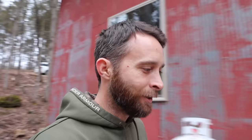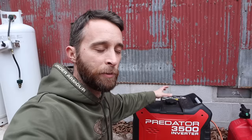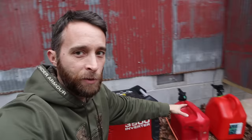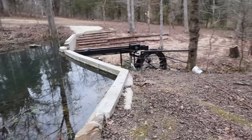So what are we doing for power? Just your trusty old generator. This is a Predator 3500 from Harbor Freight — not very expensive, I want to say about $800. I only have to run it in the mid-morning for a few hours to top off the batteries, and then again before bed, usually while we're cooking dinner. I'll usually shut it off at 10 o'clock, so we get about a 12-hour period running off the battery system. This thing really doesn't use a whole lot of fuel — two five-gallon gas cans probably last me a full week. Really happy with it for right now.